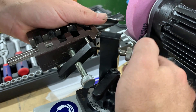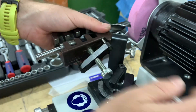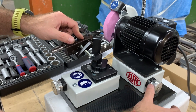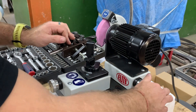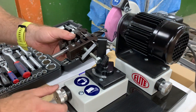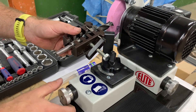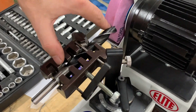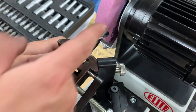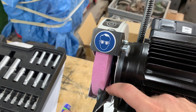We fix it, then turn this wheel — you can see that we can move it left or right, all the way to the left. Now we approximate the drill and you will see that we grind the drill to the shape. This small chamfer here and this small chamfer here will make the angle of the point of the drill.